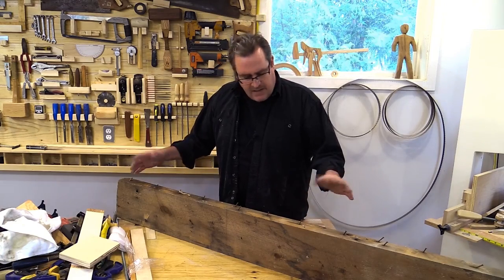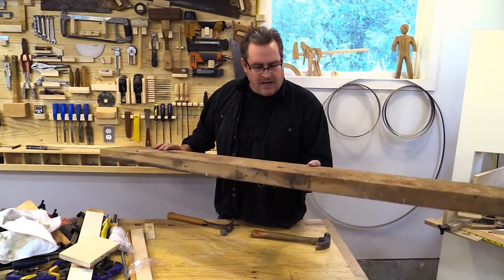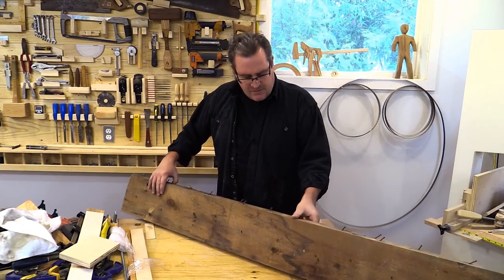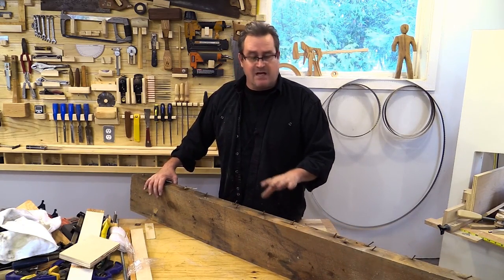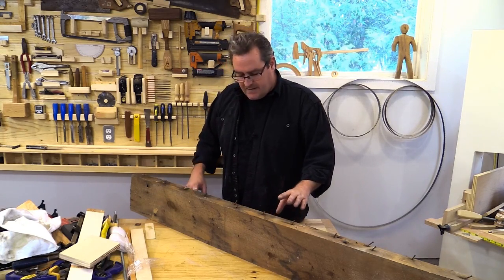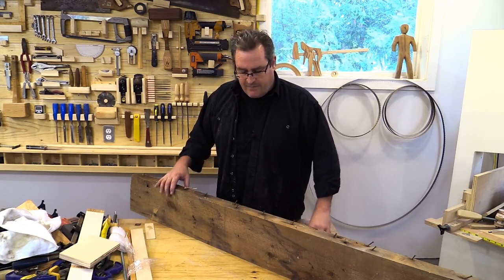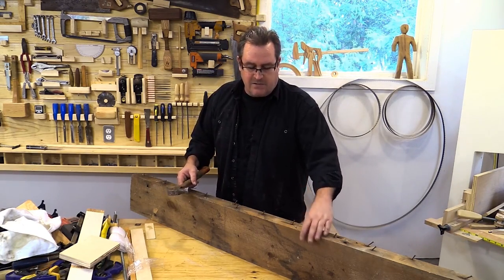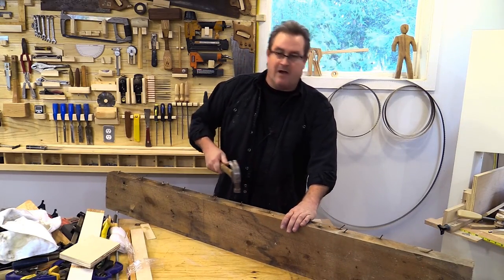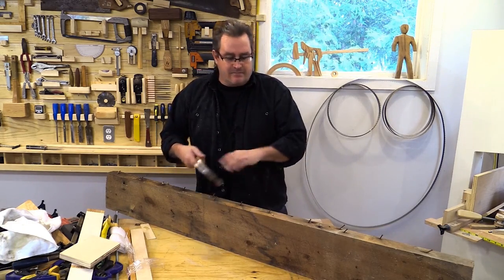Often the wood you get from a house renovation is softwood, but you can still make a lot of good stuff with that. In my case I have a rough-cut two-by-eight — a full almost two and a quarter inches thick — and it's got some nails on top because it was actually a floor joist in my house. To remove the nails, they can be tricky because they get rusty, especially the older ones. I find the best way to get them started is to drive them in a little bit first, which breaks them free and breaks the rust around them.